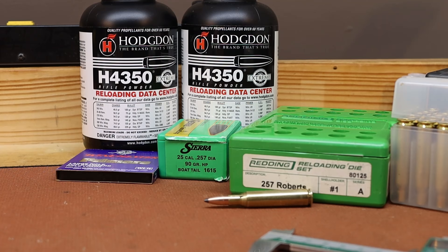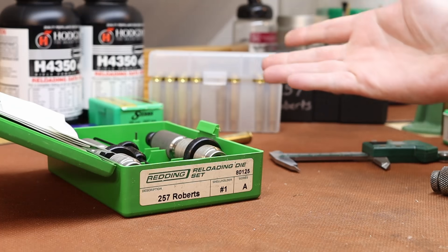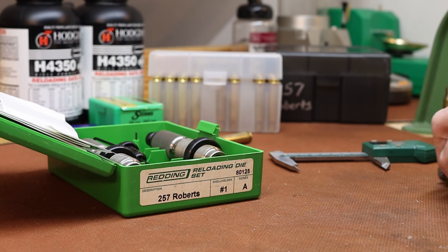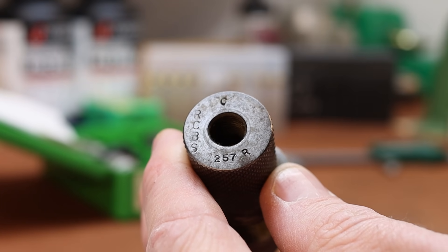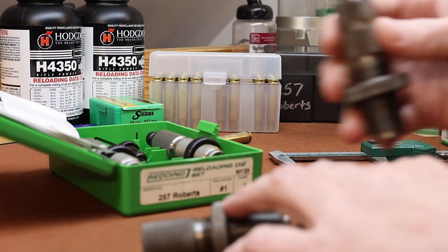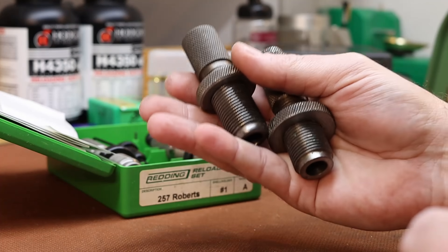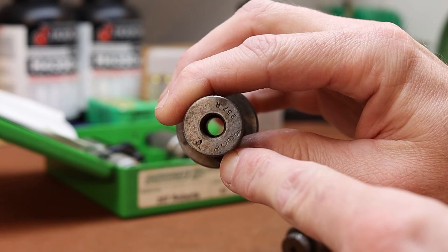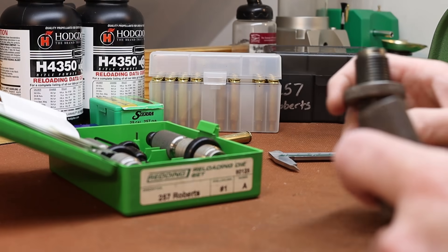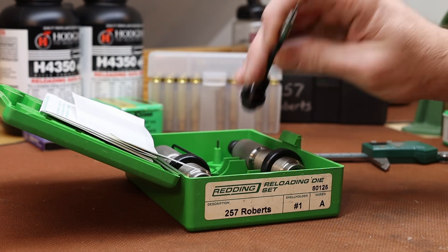We need to size some brass. I noticed a little bit of confusion when I realized these dies were covered in grease — they're brand new dies I bought about 10 years ago, around the same time I bought that box of factory ammo, then realized the bolt had that big crack in it. So I went into my grandpa's old stuff and found this — an old RCBS 257 Roberts sizing die that's missing the expander. Also found this old Hollywood die — a 257 crimp seat die from Hollywood Gun Shop. My best guess is those rounds with the janky necks: my grandfather had sized that brass with the die that didn't have an expander and was like, screw it, I guess the bullet's the expander. That's why they had way too much neck tension. So I'm feeling a whole lot better about things — I'm going to get this brand new die set cleaned up with its perfectly sized expander.